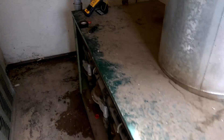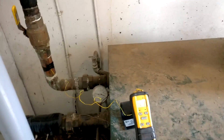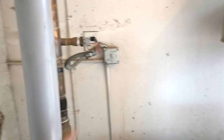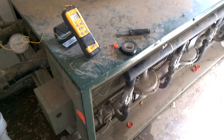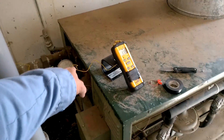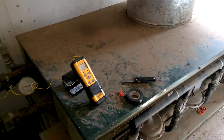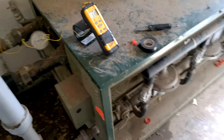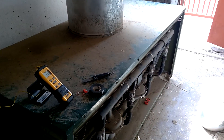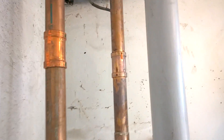Right now we found a bunch of bypass valves closed, and that's why this sucker was overheating like crazy. Everything's worn out on this thing, including the flow switch. Now I'm just fine-tuning the boiler — it has four stages that you adjust on the valves with four little thermostat bulbs that go to each one. I'm staging them up and then going to check out some other stuff. I'll show you some pipes again in a second. They really are all interconnected. Never seen that before.